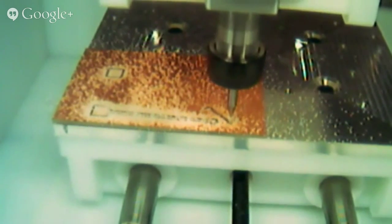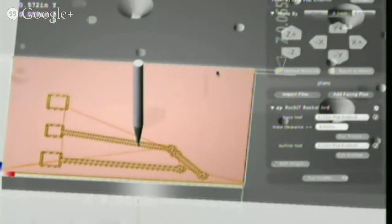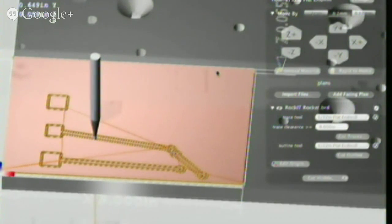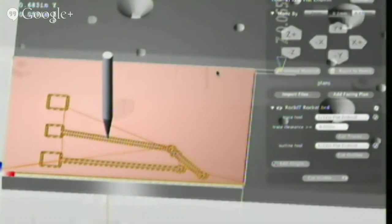So, your materials, how soft a material can you go? Would you do something like brass, for instance? Yeah, brass machines really, really well. Aluminum too. It can't cut really hard metals, like you can't really do titanium or steel, because they're really hard, the machine doesn't have enough torque, and also you need lubricant, especially to machine things like steel, and the machine doesn't handle it. Usually you have water pouring on this when you're machining? No, it's lubricant, it's almost never water. Oh, okay.